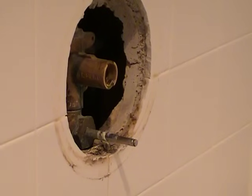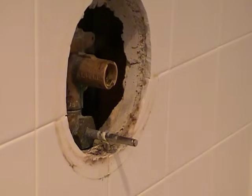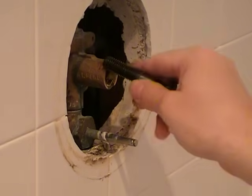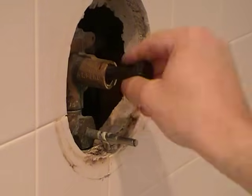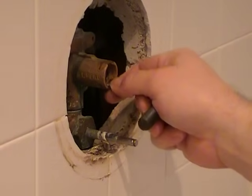So a couple ways you could go about doing this, and I just wanted to show you this. Someone had recommended using a socket, which I think is a good idea. Also, I bought a variety of washers. I imagine that might work too. You're creating a puller. Once this bolt gets threaded all the way down and seated, it will start pulling on these. However, if it's flush, I think these ears are going to block the pulling action.